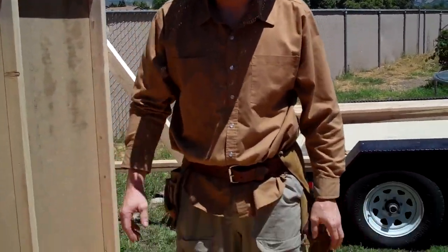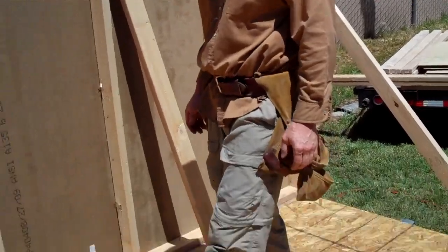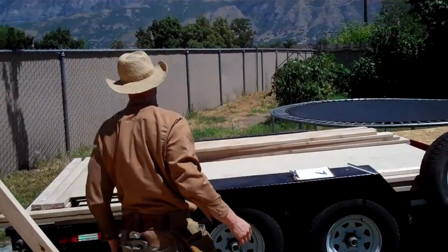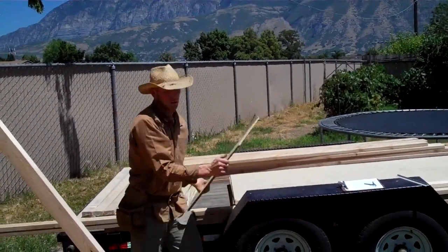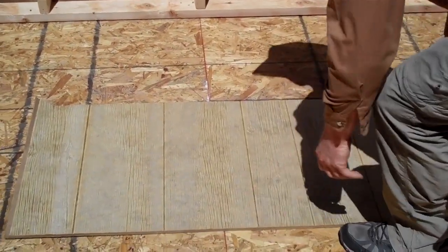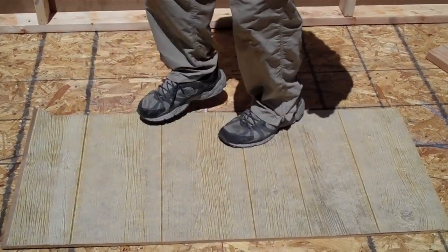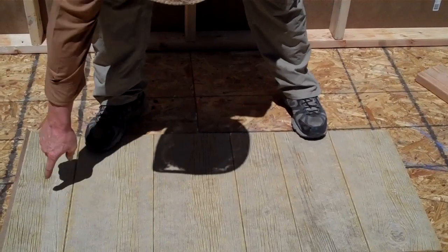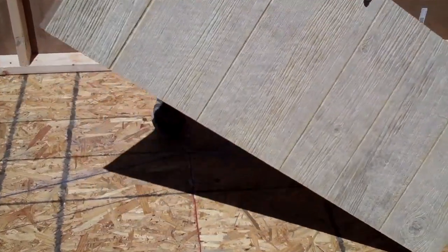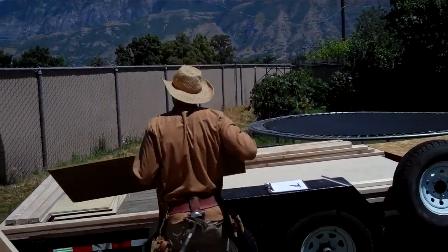As you lay all these out, you can trace them to cut them, then lay them back into place and put your truss joints together. You can lay the material over the layout, put it up to your nail, and run a chalk line across to mark your first piece. You can work directly on the board or trace onto cardboard first and then onto a board. You don't have to know a lot about geometry to do this.